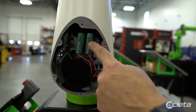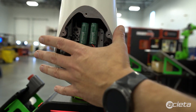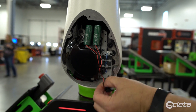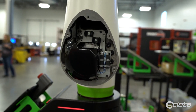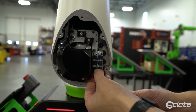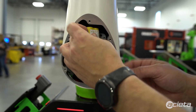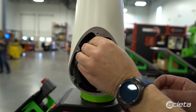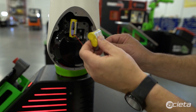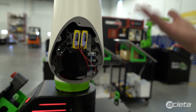So these are the two battery packs, and this is where they plug in to power the pulse coders. Make sure your power is on — very important. Just unclip the clip, pull them out, take the new ones, plug them in, and clip them in.